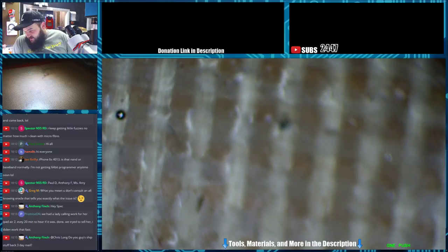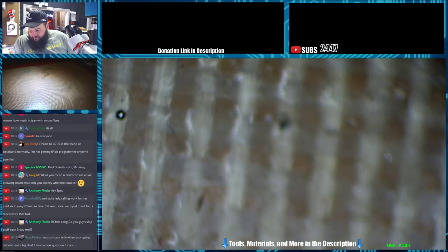Alright, so first things first, we're going to check TriStar on this phone. TriStar is working. We're getting an Apple logo that will shut off and then it'll loop again and do it over and over.